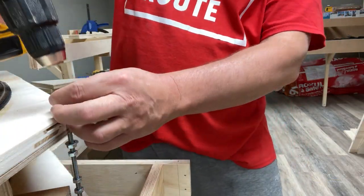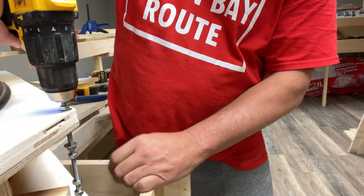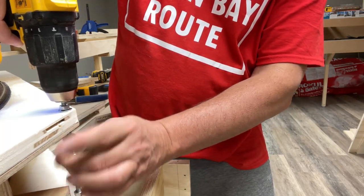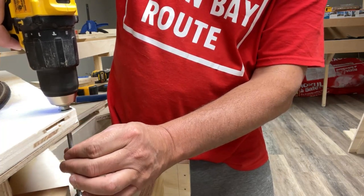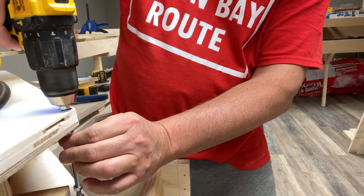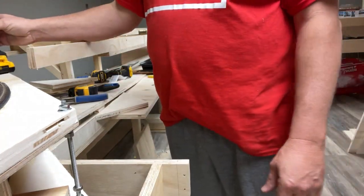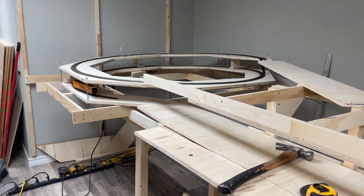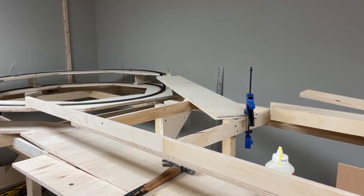When I mentioned using the cordless drill in the past — you can actually put the cordless drill on the thread rod itself. You can see everything is spinning, and when you hold the nut it'll travel up and catch the other nut. That's just another easy trick to thread the nuts onto the rods. So now you guys can see how the helix comes together.